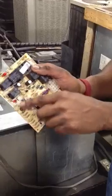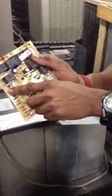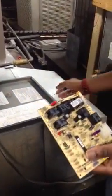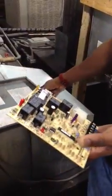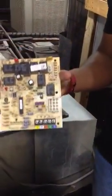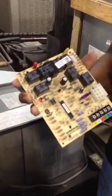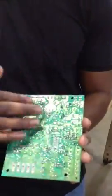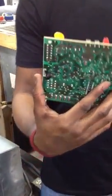You have a fault recall on your board — this is the little light that's going to tell you the operation of your unit. It should be a steady light anytime the unit is operating correctly. If it starts blinking, you have to come to your board and look for your codes to troubleshoot. All these right here are your relays. If they go bad, it's a good idea to just replace the board versus trying to unsolder and resolder them. If one of these relays burns out, you should see a burnt spot on the back of your board. Water damage also messes the board up, so protect it from that.